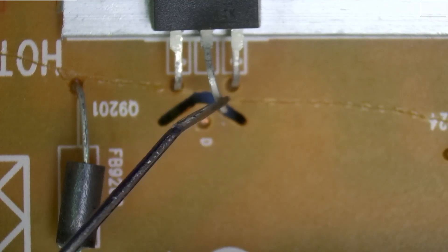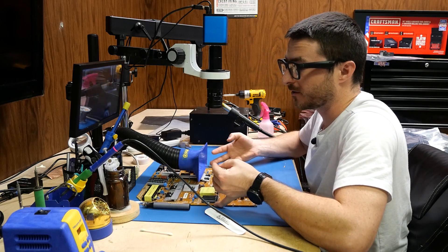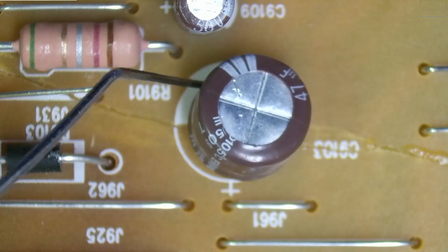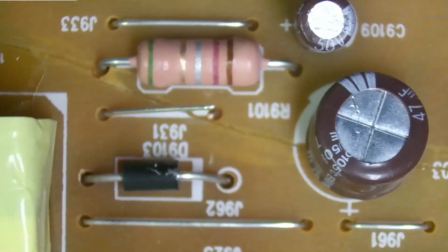Probably actually replace the transistor entirely. It looks like that got ripped out. We have a few other components just like that across the board. This capacitor will have to be replaced — I think only one of the legs is actually soldered in, the other one got ripped out.